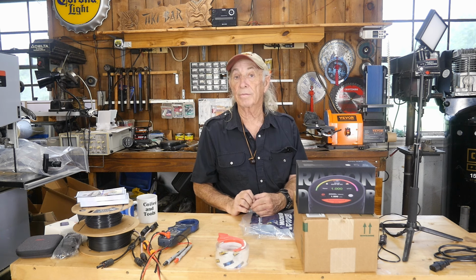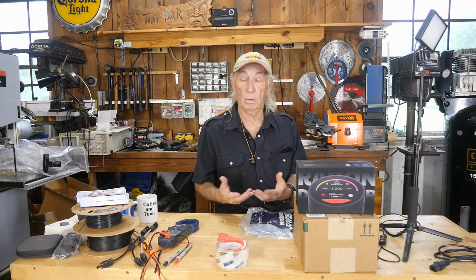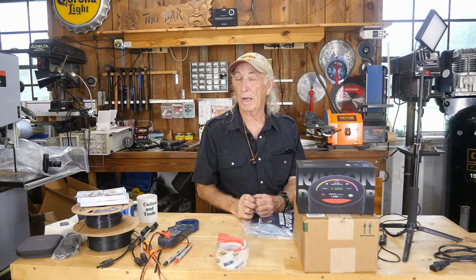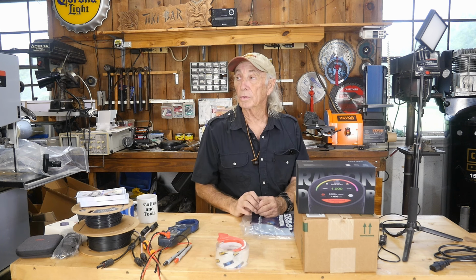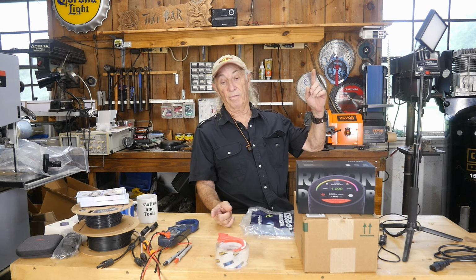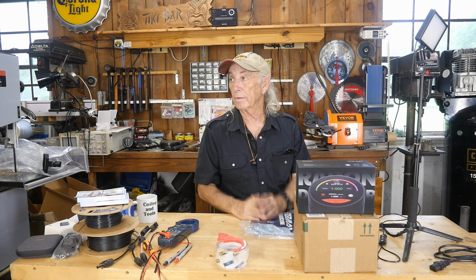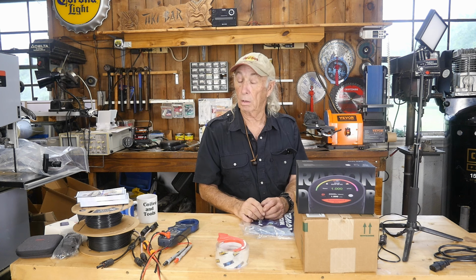I've run out of parts on it. We just filled an order and I don't have any more, so I've got to start pumping parts off the SK1 again. And I've got a problem with it because the filament needs to be dried first before I can run it. Drying filament is really funny. I've got the Creality dryer and I have to use it, but I'll usually run it for several hours before I put it in, and then I'll take a good 3, 4, 5 feet of spooling off first, cut that and trash it, and then start feeding it in. Because if it starts to get hard and crack or split, it'll goof up, and then you've got a heck of a mess to clean up inside the machine sometimes. And I've had those days.